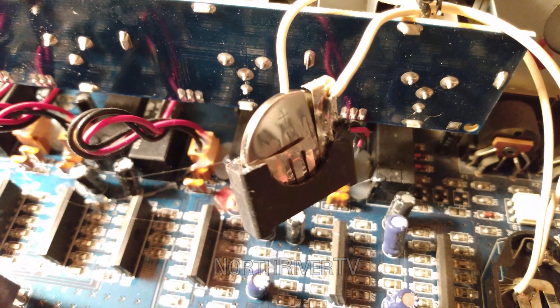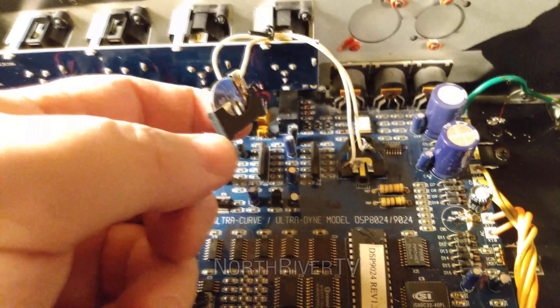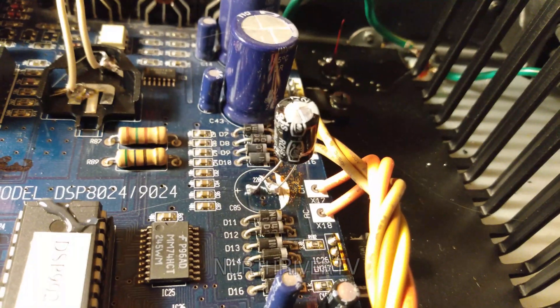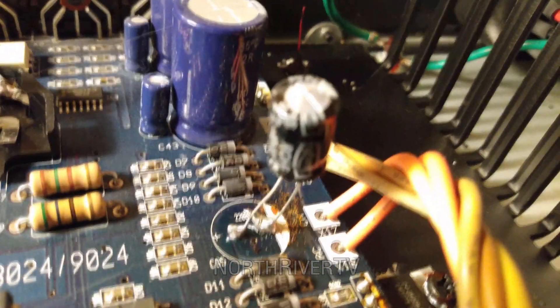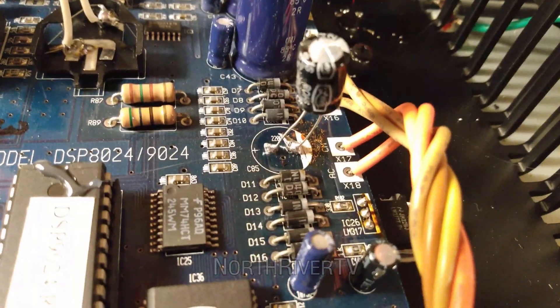Okay, we got her open here. The first thing I did was change out the standby battery for the memory. I boogered this connector in because when I went to change this out several years ago, the original factory connector just broke apart — it was so brittle. Anyhow, that is the suspect cap right there. The original one leaked and had this same issue, so I just tacked one in. It's not the right value, but I can already see the top of it starting to pop.